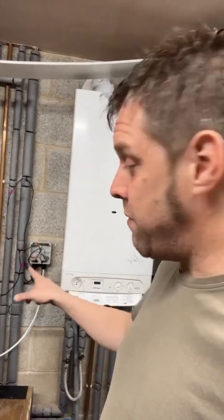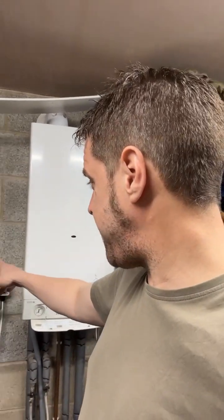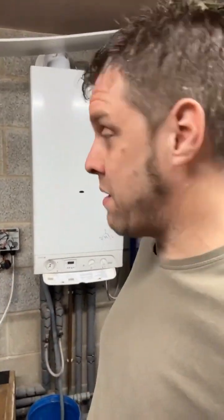I've got Shelly electricity meters in my house — four of them: my fuse board, my battery, future solar, and my incomer. I'm gathering all that data. The key thing about Shelly is if they go bankrupt, it all works locally — it sits on my local network, no web browser needed. It'll work with home automation so I could say: if it's freezing outside, turn the boiler on; if it's warm and there's a heating request, don't turn it on.